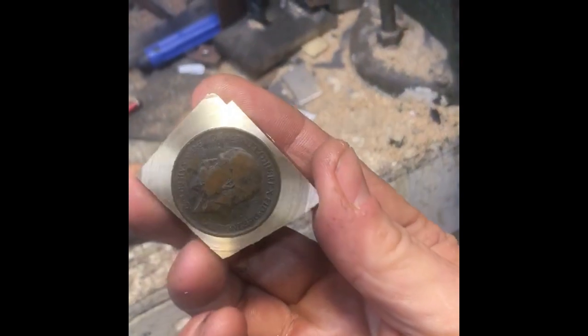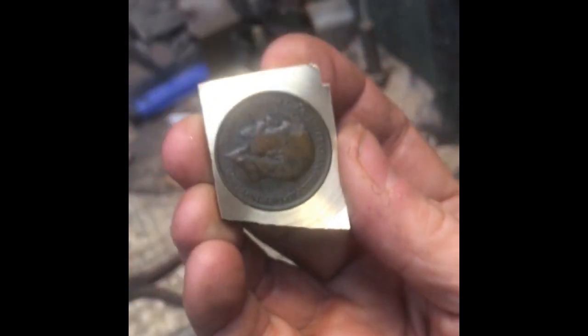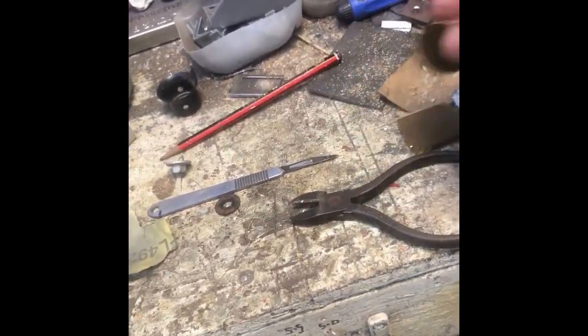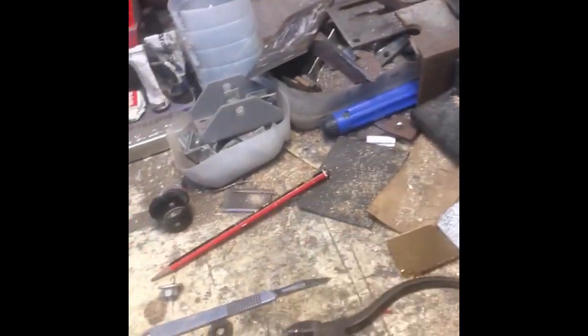This is the penny in better light. That slight shadow you can see around the perimeter of the penny is actually the curved edge to the penny — it's not a gap. The thing really does fit tightly and I'm really pleased with that. I've just started putting some emery cloth on and polishing the edge of the penny so that it will take the solder. I'll put some flux on both parts, heat it up, and see how we go.